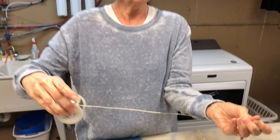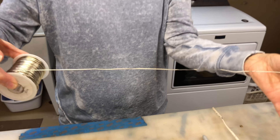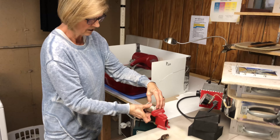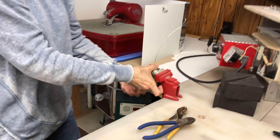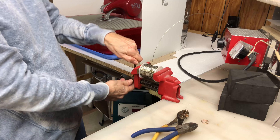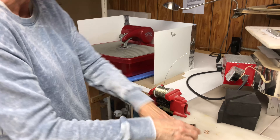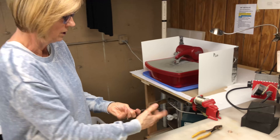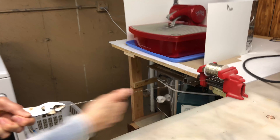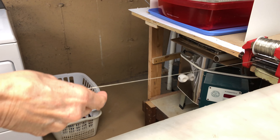For this project you'll need 18 gauge tinned copper wire. It's thin and pliable but has enough body so that your antennas will hold up well. You have to use copper wire in order for the solder to adhere to it. If you can't find tinned wire — I do have it here in the shop, you can buy it by the foot — but if you have copper wire at home, all you have to do is flux it and tin it with some solder. If you want it to be silver, otherwise you can leave it copper color — that's your choice.